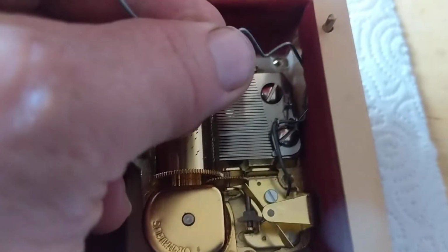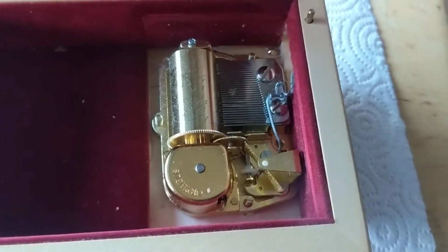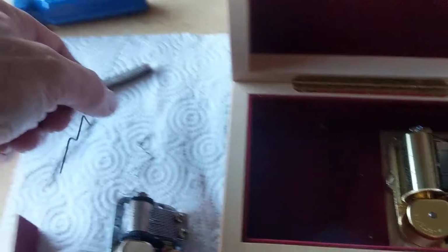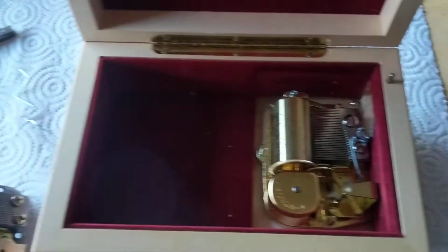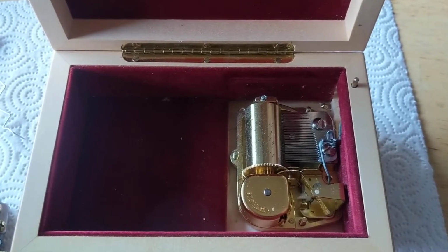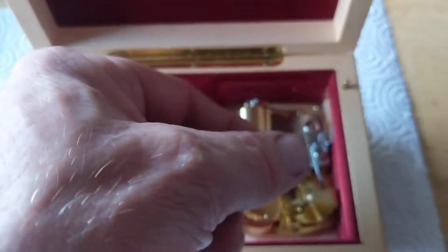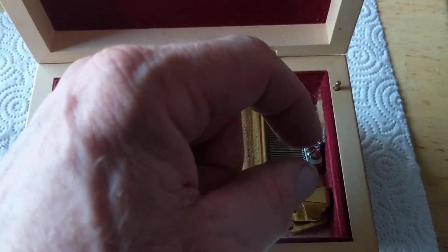And then on this section, the wire goes through a little hole at the bottom of this brass pin. And that's what makes it stop and start. It took me a couple hours actually to get this wire perfect. You can see examples of rebends. This was the original one. But with playing with it, there's nothing really complicated about that. I think anybody can do it. I guess there's a little worry that maybe you might break the spring, because it'd be hard to find that spring, because you do have to kind of widen the opening that I was holding onto the old wire and then squeeze it back.